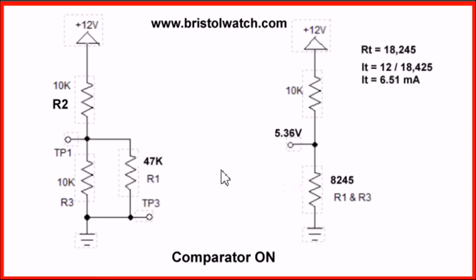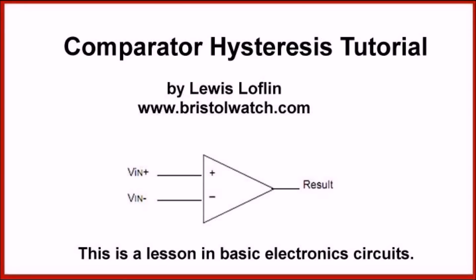Note that your calculated values are going to vary somewhat from your real measured values because of tolerances in the resistors and the comparator itself — that is normal. If it's within five or ten percent, no worry. If you want to measure each resistor and use the exact resistance, of course it will come out closer. But when calculating things like these resistances there will always be some variation — it won't be perfect. That's something engineers often have to deal with. Sometimes engineers can calculate everything fine, but then you might need a technician to figure out how to get it to work in the real world.